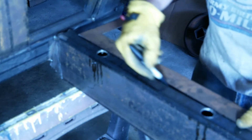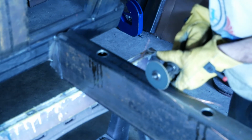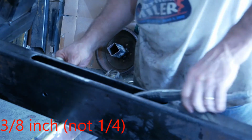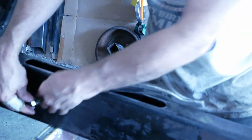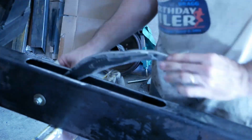Drilled a pilot hole with a little bit, then drilled them out with a hole saw, connected the edges, and cut the channel out completely with a cutoff wheel. Once I had that done, I used a piece of salvaged 1/4-inch scrap metal that I don't even know where I got, but drilled a hole in that and then in the upright, and used a series of spacers to connect the foot pedal to give it a pivot point.